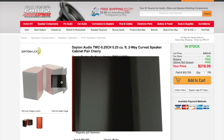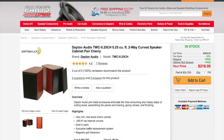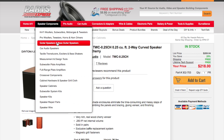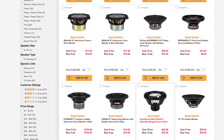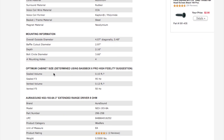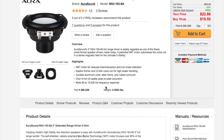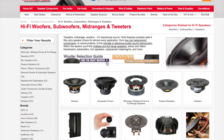This particular pre-built cabinet just requires you to cut a hole in the baffle for the woofer and tweeter. They look pretty nice and are $218 for the pair. Looking at woofers, here's one at about $22. What's cool is they tell you information about the optimal cabinet size — whether it's a sealed or vented cabinet, where the F3 is (that's where the bass drops off by 3 dB), and there's a calculator that tells you how long the vent tube should be.